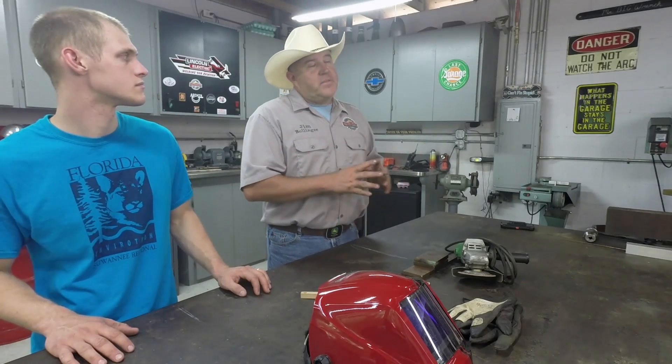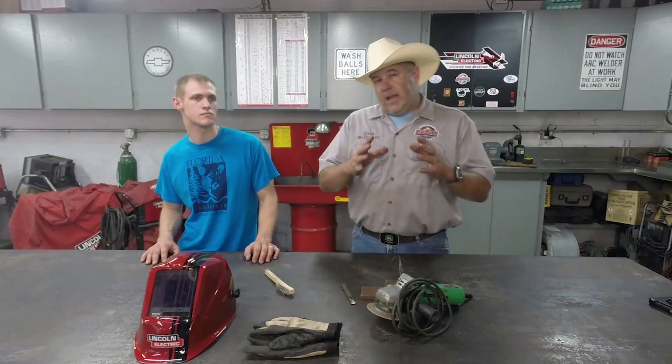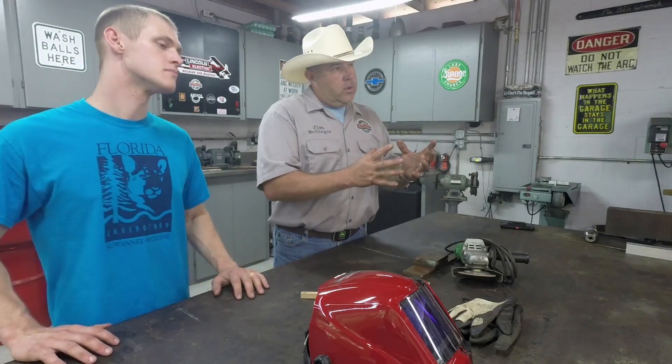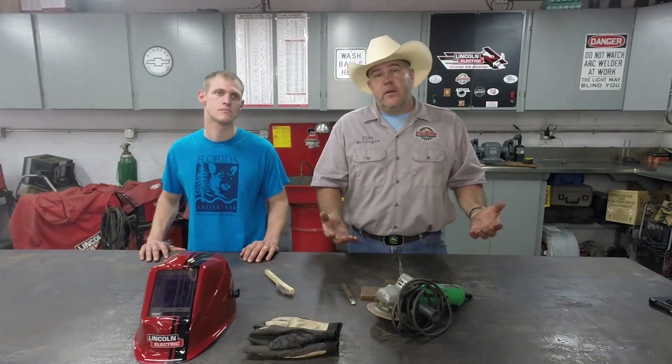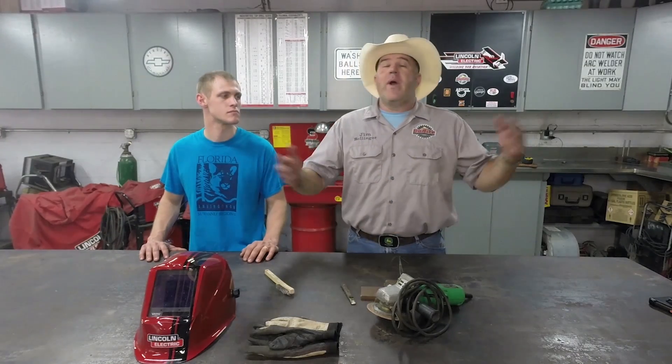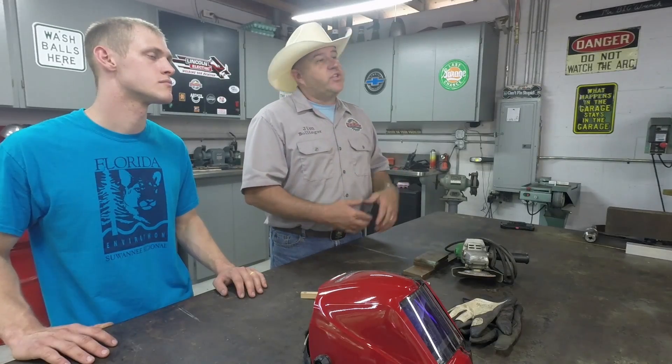Boats can sometimes present a challenge similar to a bowl in your kitchen — you take the bowl over the sink and fill it full of water. A boat hull is a lot like a bowl. When we weld, we use argon as a shielding gas to keep the atmosphere away from the molten weld puddle. That argon is not poisonous — we can breathe it, it's in the air naturally. However, it is heavier than air and it does displace the oxygen out of the atmosphere. So if we get down inside that boat hull and start welding, we can push away the oxygen we need to breathe and put ourselves in a very dangerous situation without even realizing it, because argon has no odor.